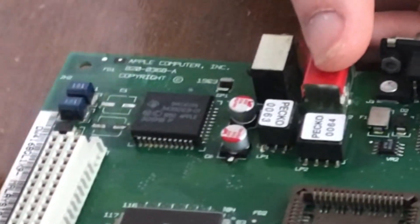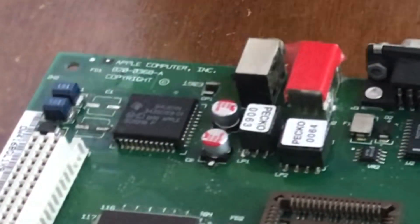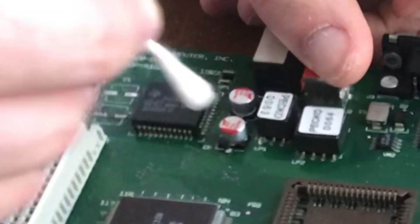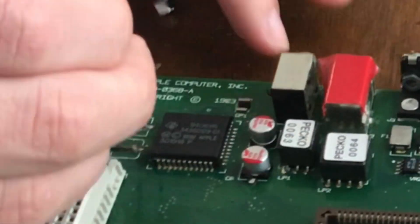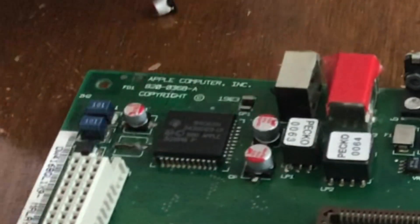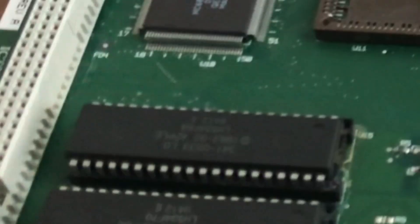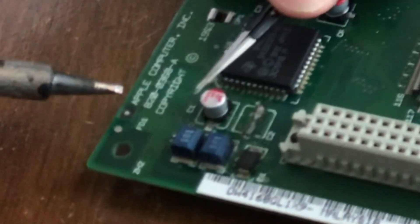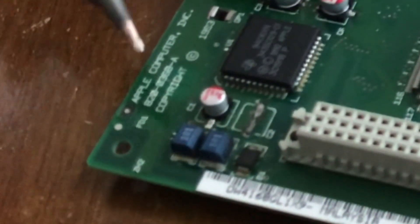Here I am cleaning some excess solder paste off the board with a Q-tip. This is not the recommended means of doing this, as you could push solder into vias where it should not be. However, there were no vias in the vicinity of these caps, so I had no fear, and I was going to clean the board in contact cleaner anyway — this was just to keep the workspace clean. Now I'm placing more capacitors down. Please note the orientation of the capacitors: the red line indicates the negative side on a polymer or electrolytic capacitor. It could also be black or blue depending on the manufacturer. A tantalum capacitor, which is completely solid state, has a line that indicates the positive terminal.